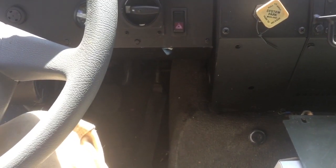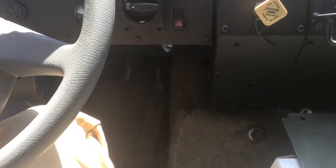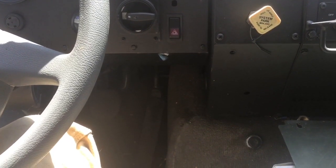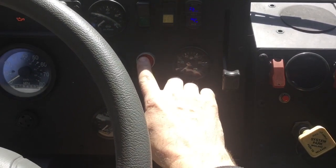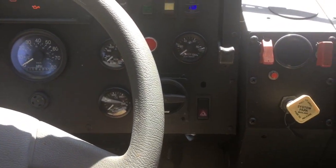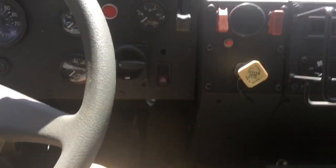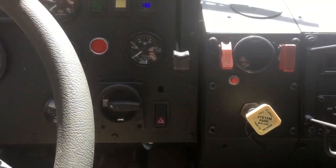You're going to give it new info by using your pedal to fully rotate that throttle block between the idle and high speed stop position down on the governor — that mechanical thing you confirmed right at the beginning that your pedal is actually able to do. As soon as you're done pushing the pedal and storing that new information, push the start button and start the engine. Take the truck out and drive it — drive through all the gears, upshifting and downshifting, so that the transmission can relearn all of that shift point information.